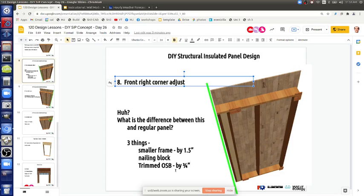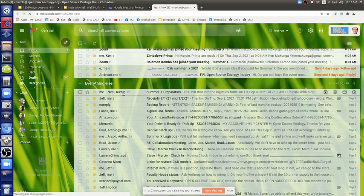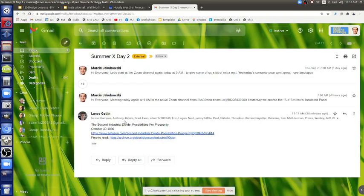This will work out in ways that you could have threaded adjustments so that you have a movable wall, maybe a triple wall where you can crank out some screws and it can slide in and out and make minor adjustments. I'm not suggesting it for this, but some way to make it less finicky so you're not cutting strips, and you're still working with the same standard pieces of lumber. It's almost like a woodworking vise in reverse. A woodworking vise has a big screw on it, and it can suck in this piece of timber on the edge of your woodworking bench. But I'm suggesting you work that screw in reverse to push that piece of wood out to butt up against the next module. Does that make any kind of sense?